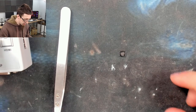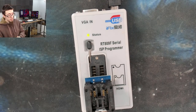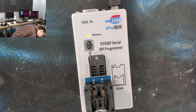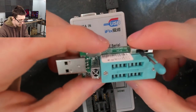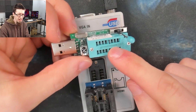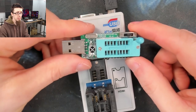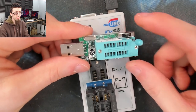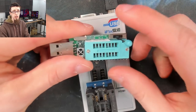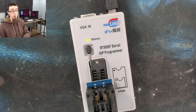We've got to put this into a programmer so we can read it. Today I'm going to use my RT809F because it's the one on the bench. If you want a cheap entry into doing your flashing, I've also got videos on using this CH341A mini programmer — it's the V1.6, they're on V1.7 or V1.8 now. The modern versions with the voltage selector switch are really cheap — like 20 to 30 pounds or dollars. I recommend against buying the older model with the black PCB because you need to do volt mods on it to make it usable.